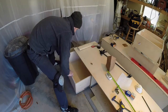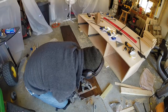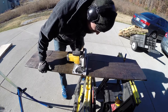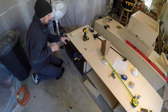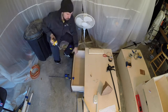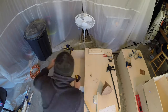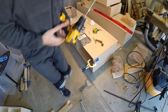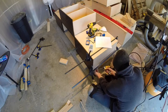I added a couple coats of stain and a couple coats of poly with a light sanding between each coat. To mount the drawer faces, I used some 2x4 spacer blocks that were conveniently the same height as the frame below, and clamped the long piece in place. I marked where the faces needed to be cut at the halfway point on the supports and made my cuts with the circular saw. To attach the faces, I got them back into position with the 2x4 spacers, clamped them in place, and screwed them in from the inside of the drawer. Initially I was still debating going back and finding some reclaimed barn wood, so I didn't glue them into place at this point — but after getting everything together, I decided I liked it and added the glue and screwed it all back together. For the faces that didn't attach to the drawers, I made a few pocket holes and screwed them in place; I can always come back later and add more drawers or convert this into some kind of hidden storage.